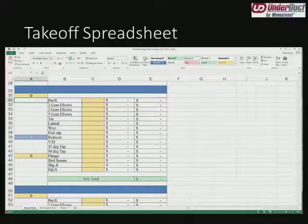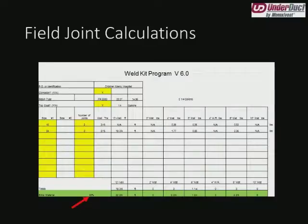I'd like to point out that nothing says 45 or 90, because to us the cost of the elbow is more about the material and labor put into it than the actual angle. Typically any elbow larger than 45 degrees but 90 or shorter will be a three-gore elbow in underduct or a five-gore elbow in corrosion. Anything 45 degrees or less will be a two-gore elbow for underduct or three-gore for corrosion.